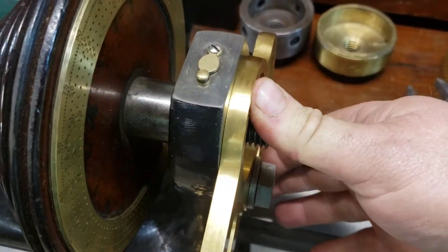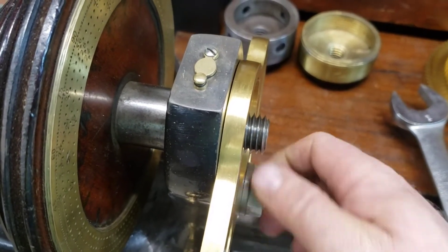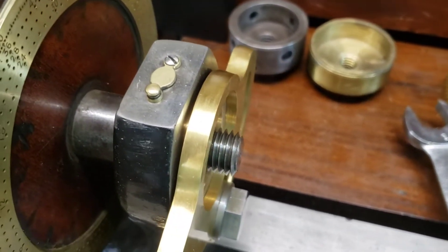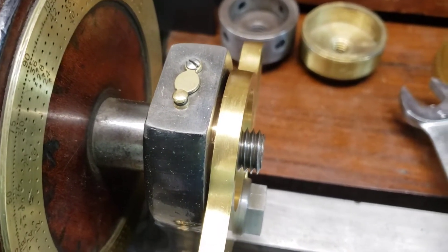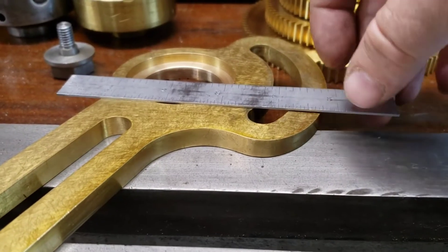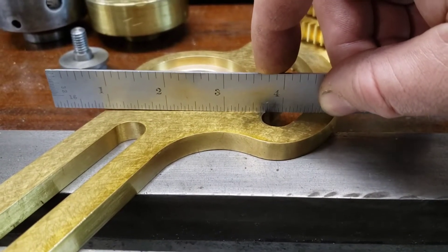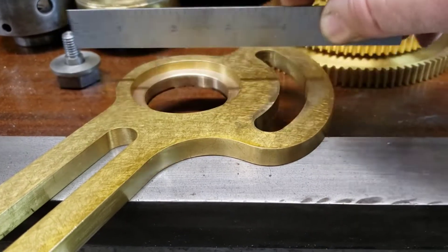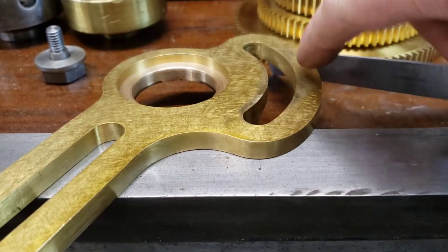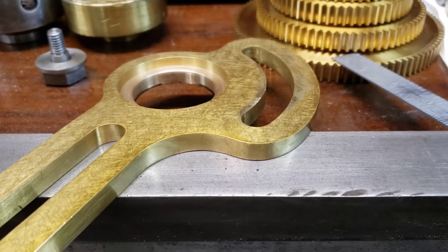Here's what I'm talking about — that's up flush, this is the bolt underneath it that holds it in position, and when you tighten that up it jacks that out. I've discovered what the problem is; I haven't quite decided how to fix it yet. I've discovered the problem with the banjo: at some point in its life it's become bent right here, back here just a little bit, so this whole piece here is bent down.